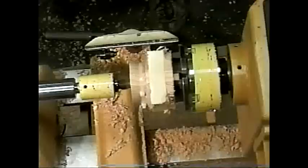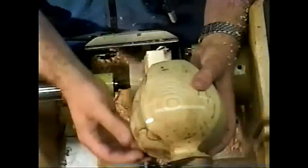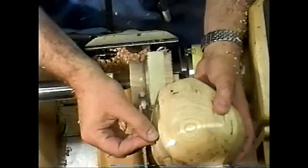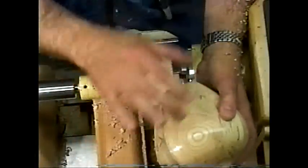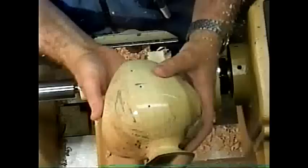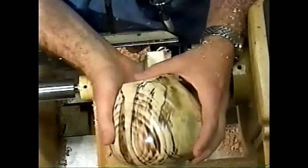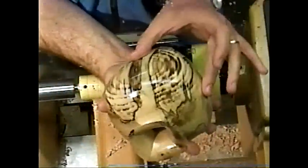Okay? And that little piece, if you look very carefully at the corner, the edges, and I'm sure this won't show in the camera, but here the seam is just, I don't know. That's not an eighth of an inch, but it's a hair from where the actual vertex is. And that's, when I glued it up, I glued two pieces together first. I knew this was going to be my face with all the figure on it. So I glued those pieces up and made sure they were perfect.